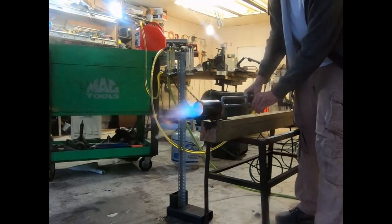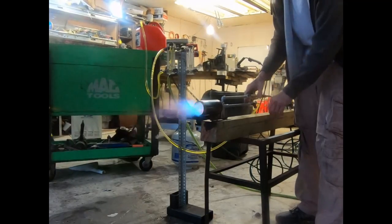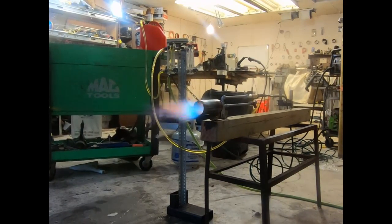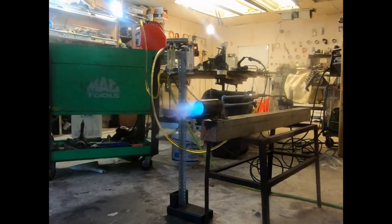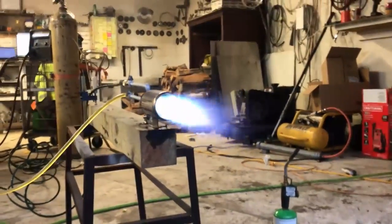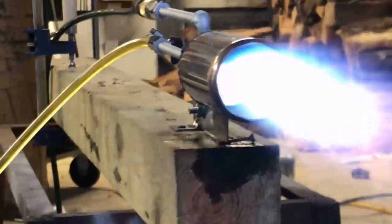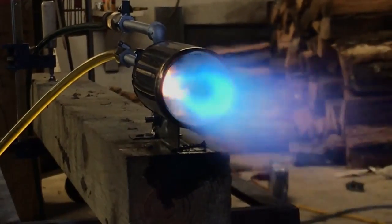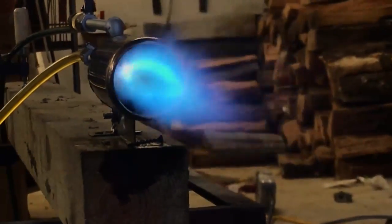The inner pinstock of this nozzle was off by like maybe two thousandths of an inch, maybe a hair more than that. And it was causing some very strange inner turbulence characteristics which are now gone. I have perfectly aligned this nozzle and you can see we're getting a pretty uniform combustion. However, there's still some problems inside of this combustion chamber.